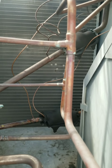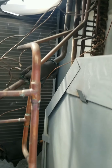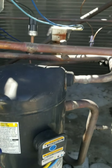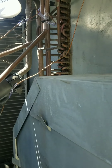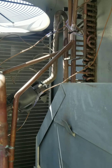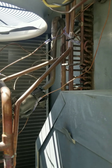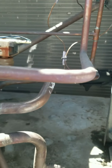We're gonna straighten all this up. I'll show you how I like to do it - typically I like to do it on startup, but here I am and I've got the time. I'll take a little quarter inch tubing, split it, and get everything wire tied. It's not the most beautiful thing, but I can walk away from this knowing I'm not gonna be back changing a TXV or fixing one of these lines.